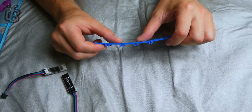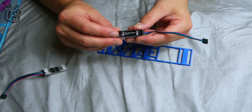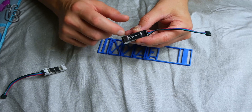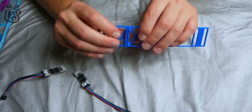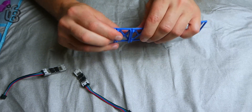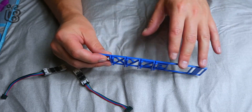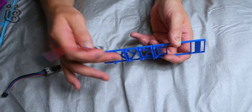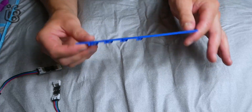Hopefully you can see — there are two little notches there and there. And on the 8-diode ones, a couple of little mounting holes, and they just clip into there. By bending these back, it opens it up — plonk them in and it holds them in there, really nice and tight. Attached to the side of the PSU, any heat that's in the diodes can come up and it's free to move and escape. They're not encapsulated in anything, and they're quite nicely safe.